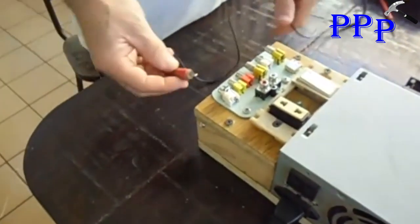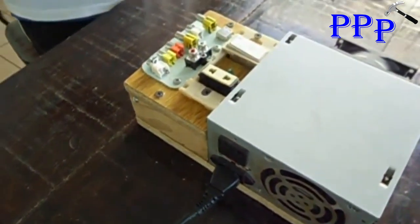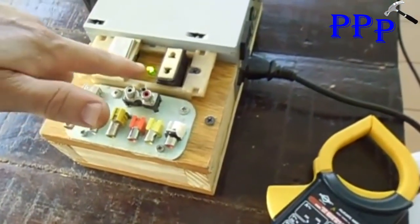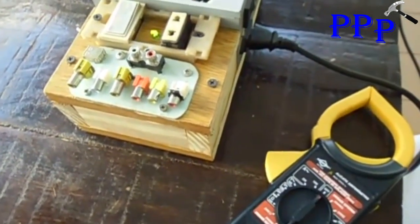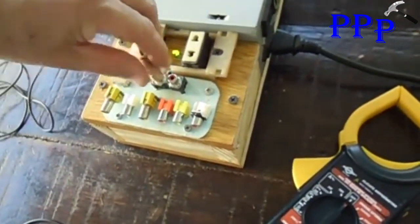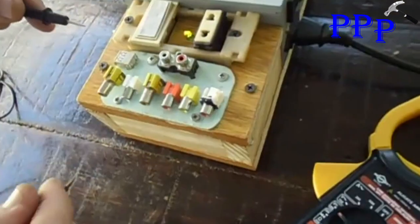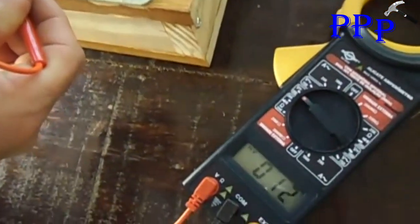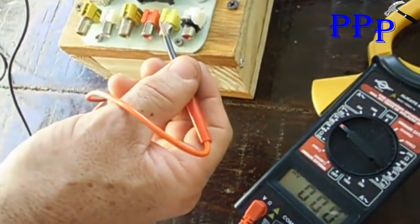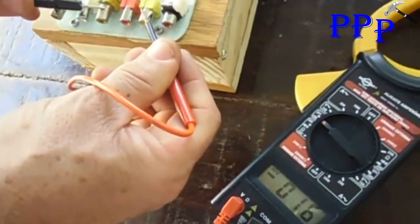This power supply is for use on your workbench so you can test electronic equipment. You can plug a banana plug in here like this to run your tests. Let me now show the operation. The LED lights up indicating the supply is running. As I mentioned, you connect one banana plug to the negative and the other to whichever voltage you want. The negative here — these are 12 volts positive; this other yellow I also have 12 volts. On this one I have 12 volts negative.